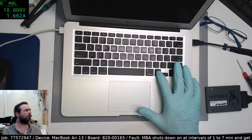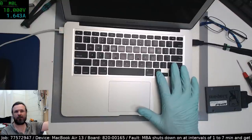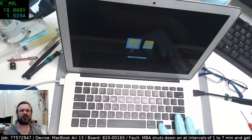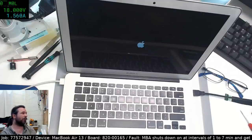I'd say the temperature sensor probably acted up because it might have lost power first and then just sent erroneous, trashy values. Does Max have a problem with fans causing problems on the sensor lines? Not that I'm aware of. Well, in this case, Pianov, I would still probably replace the ISL just out of precaution, since it's a fairly easy chip to replace. And if we still have it, then yeah, we'll go for the SMC replacement.